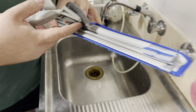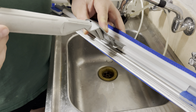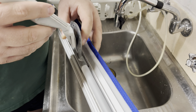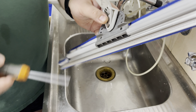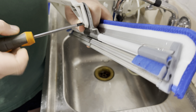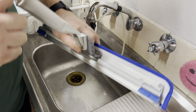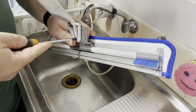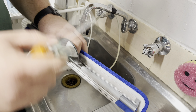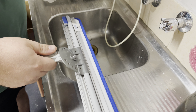One of the common things I see is this screw here is not tight enough, so this handle ends up flogging around. This is probably a bit exaggerated, but when it's loose like that it can wear out these discs prematurely. All you need to do is take a Phillips head screwdriver and tighten it up. That's too tight — I'm just going to back it off just a tiny bit. There we go, much better motion now.